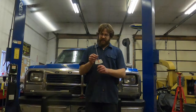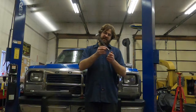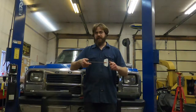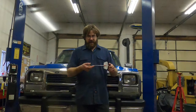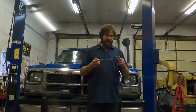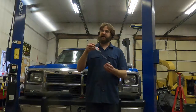I'm going to start out with the cheapest unit here. I call them a flex beam torque wrench. Basically what you've got is two beams — this is a calibrated flexible beam, and then you've got a pointer. So as you twist it — I'm going to bend it a little bit, this is a super cheap torque wrench — as you put it on a fastener and twist on it, this beam moves out and you've got a scale right here.